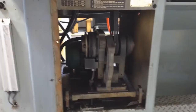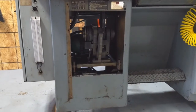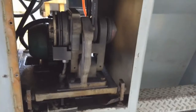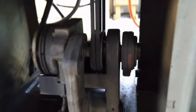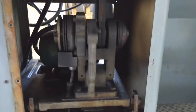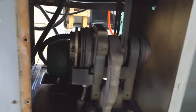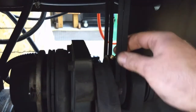I went and took the entire door off of the front of the machine — I'm going to be working in there for the next day or so and just dealing with that door was something I didn't want to do. This is the drive system. It's a pulley swap type system — you swap the pulleys out to give you different speeds. There's a clutch in here, an entire countershaft, an entire cast iron apparatus for the countershaft. All that will be coming out, and the motor is just going to go directly up to the spindle where these belts are now going.